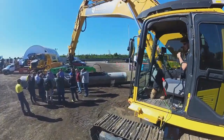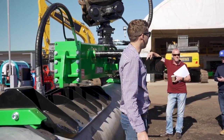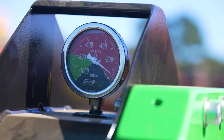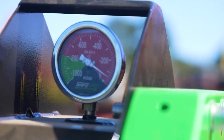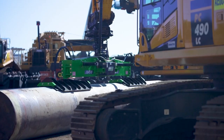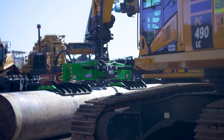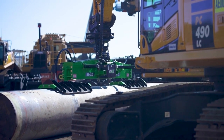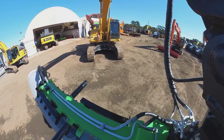That's also accompanied by analog gauges mounted opposing one another at each shoe, for any bystander or spotter in the vicinity so they can see any pressure discrepancies between the shoes and know that it's unsafe. If we ever reach an unsafe low pressure, we have red beacons either side of the head bracket and one on the rear, and they're also accompanied by an alarm system.